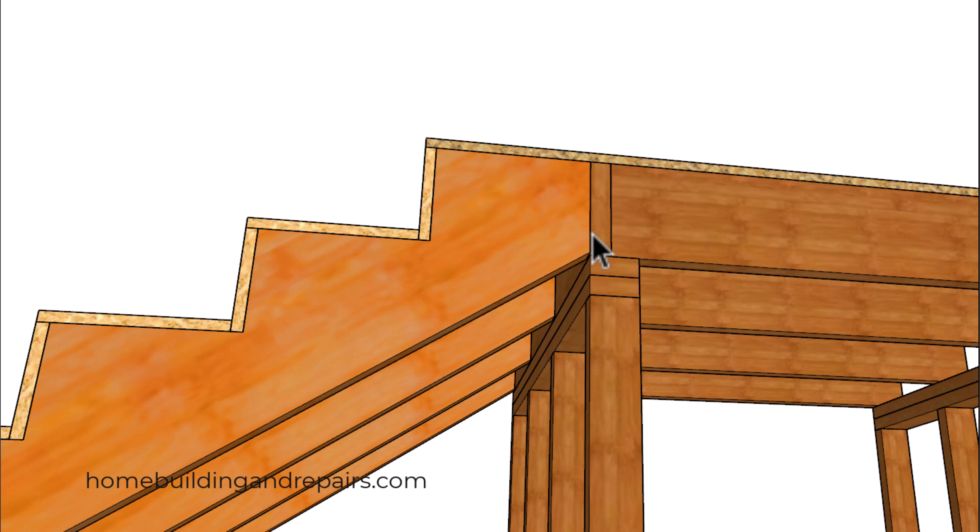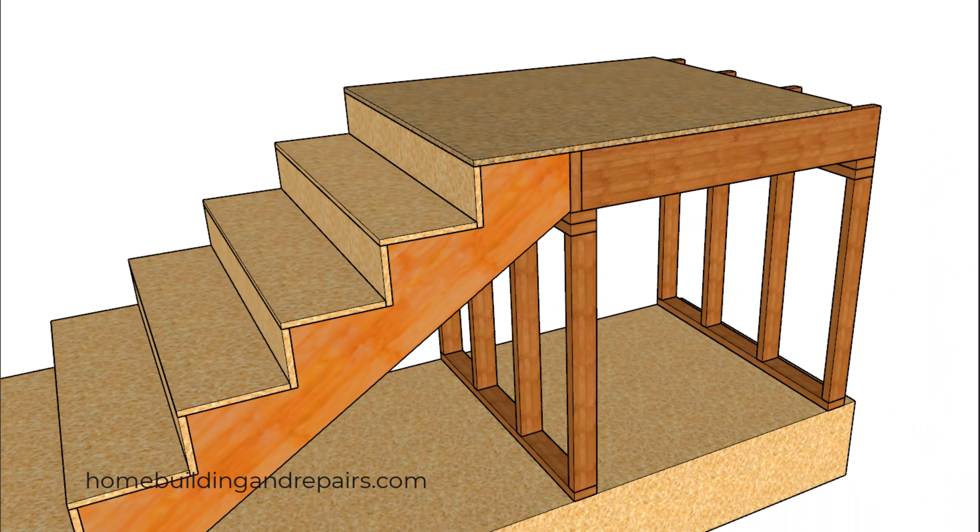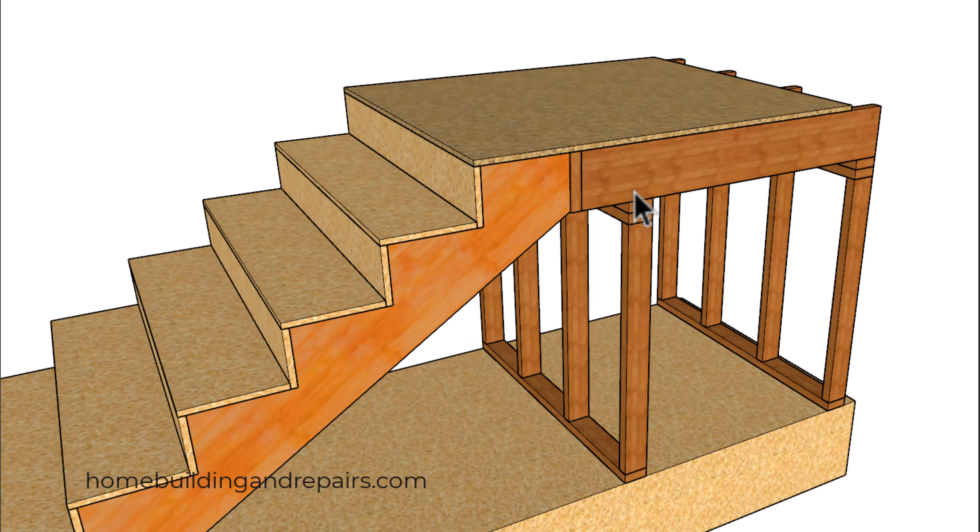To get this result, all we need to do is move the floor framing head out back or modify the floor framing so we can use this method. Some of you might not be familiar with this method, but now you should be. To make this work, all you need to do is extend the stair stringer a little longer, and this method also works with a cantilever.